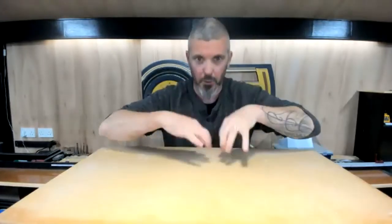Right. Now, if you're doing oil-based paint, and again, by the way, sorry, floor coverings. I rarely use floor coverings, much to my own detriment, but I would try to, especially with carpet, I'll always use floor coverings. Sometimes not with the wooden floor because you can wipe it. But if I'm using oil-based paint, for the love of God, use drop cloths, because if oil-based paint even touches carpet, it's soaked in, and it's impossible to get out.